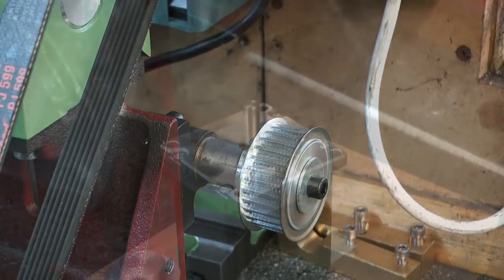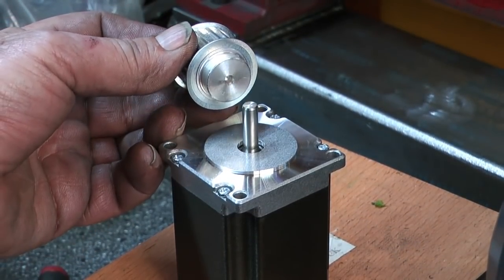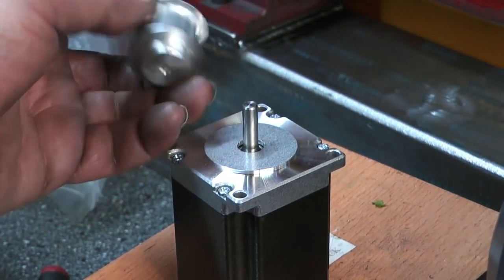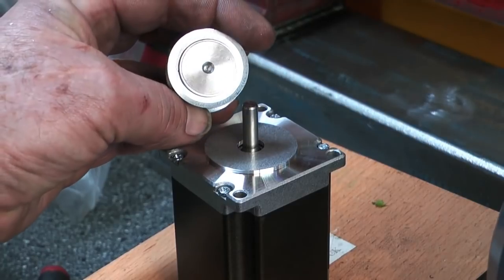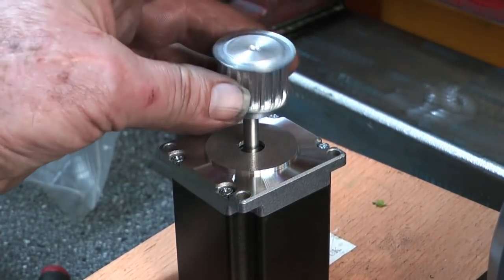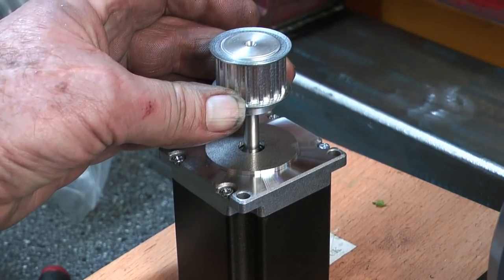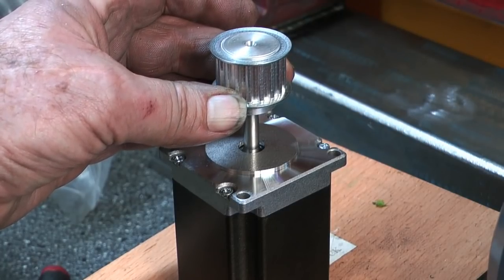Here's the little stepper motor and here's the pulley that's going on the motor to drive it. There's no hole in this one, just a centre-drilled hole both ends - I didn't know what size shaft was going to be on the motor. So I'll measure up that shaft, drill and ream a hole in there. Hopefully I've got the right reamer, if not we're going to have some fun trying to bore out that little hole.